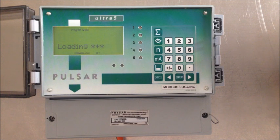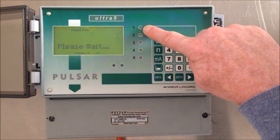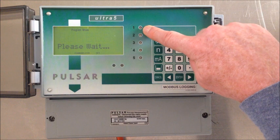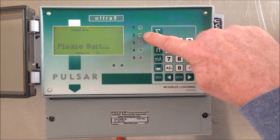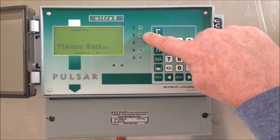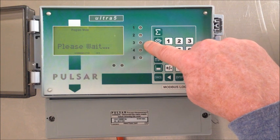What the controller is doing now is hiding all the menus that you don't need — pump control, open channel flow measurement and differential — we don't need them in this application, so we're hiding them in the background. Now for this particular customer's application, they wish to use relay one, which is going to act as the common off-level point, which will replace the lowest float switch; relay two, which is going to be the lead pump on point; relay three, which is going to be the lag pump on point.